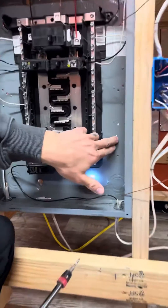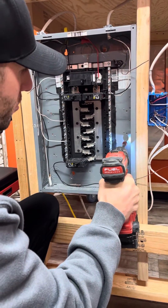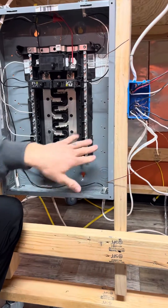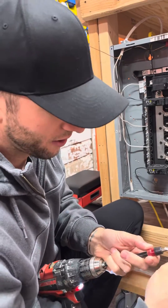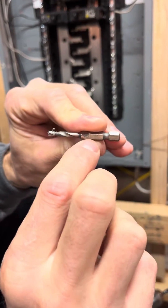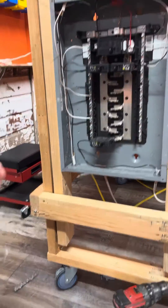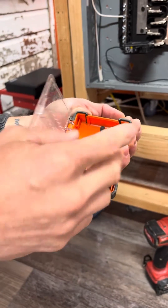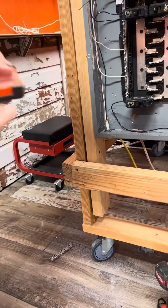You can see right where that's going to go through. From there, remove the ground bar, throw the tap all the way through, and once it's through it'll thread itself so that the hole in this metal can has pre-made threads that will accept an 8-32 screw. You can see this tap right here is designed for an 8-32. These kits typically come with multiple sizes — 6-32, 8-32, 10-32, 10-24, and a quarter-20. Today I like to use an 8-32 for a ground bar.